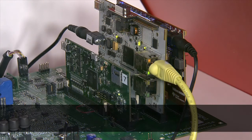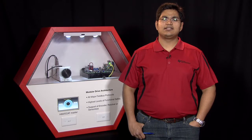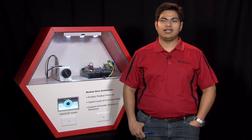The second control card is the AM335X control card which is running the EtherCAT protocol stack and communicates with the human machine interface. Third is the Hercules safety MCU control card which can be used to implement an external safety module for the drive system. The beauty of splitting the different functions into separate control cards is that this gives immense flexibility in system design and implementation.